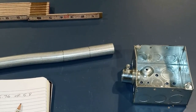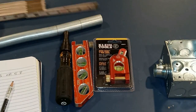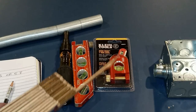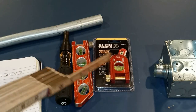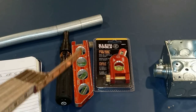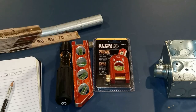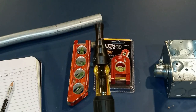I wanted to show you some of the tools that I use. I had to buy a new one — these are my go-to when bending any type of conduit. This no-dog I like to keep in my pocket at all times. I usually only use the larger one when I'm bending larger conduit — two, three inch, anything bigger than three-quarter. I do use this one too, but I don't use the no-dog on it because sometimes it likes to slide down or fall — I guess the screw on mine isn't that tight.